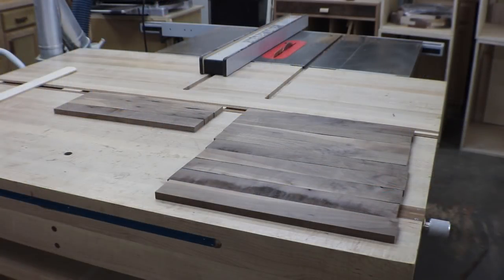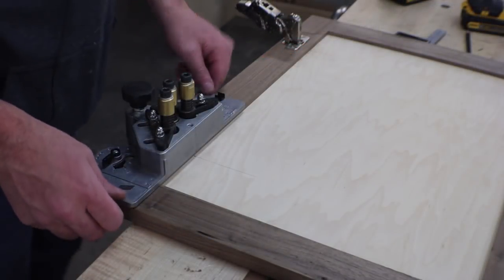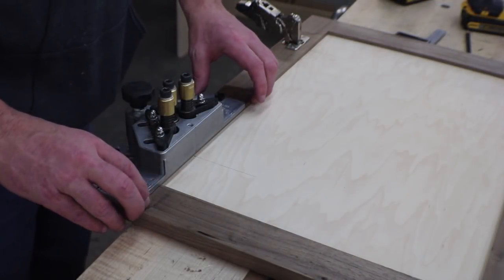So there's all the fronts and the sides that I picked - they're all just rough milled and there's still another milling to go. Those three on the left are the ones that are going to need epoxy work. It actually turned out better than I thought it was going to. There's no rhyme or reason to these - the only thing they have in common is they're all walnut. There's no grain matching, nothing - this is all purely out of my scrap bin. So I'm going to get the epoxy going on those and let everything sit for tonight.